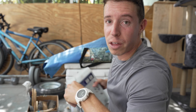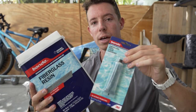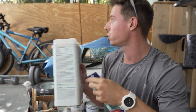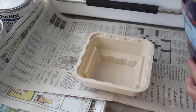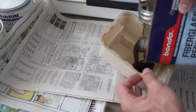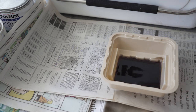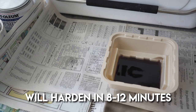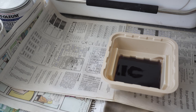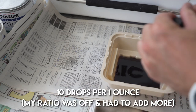It is now the following morning. We are ready to apply our resin and catalyst. I'm going to show you how we're going to do that — it's as simple as following the instructions on the can. We're going to pour this stuff; it does have quite a smell to it, so I recommend doing this outside. Once you apply the catalyst — the hardener — you have about 8 to 12 minutes before it really hardens, so once you pour it you better be ready to start brushing. We're going to apply 10 drops of hardener, mix it, and get going.